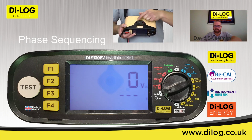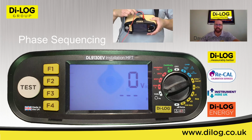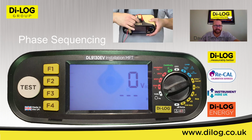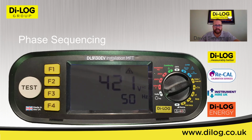So for phase sequencing, which is part of what the tester has got, and all our testers have had previously as well, it requires obviously all 3 connections on there between L1, L2 and L3. You can see I'm simulating that there. And it will then indicate voltage, and then L1, L2 and L3 will appear. If they're in that order, the phases are in the correct sequence. If there's any other sequence, they will not be in that sequence, if that makes any sense to you.